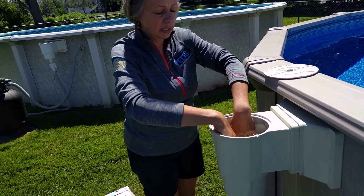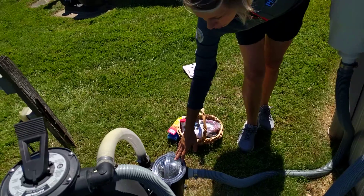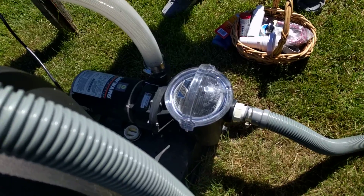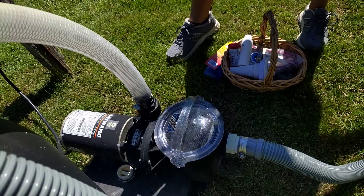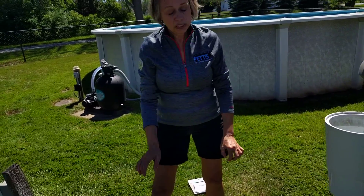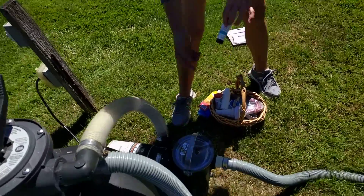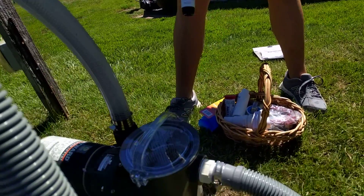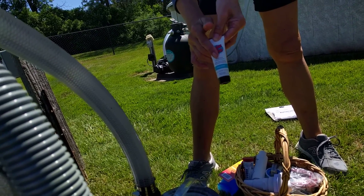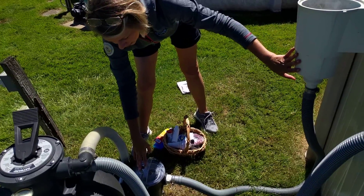So that's your first line of defense — clean out that skimmer basket. Water's going to travel from here, down your filter hose, down into your pump basket. It's got a few little things floating around in there — you certainly want to shut that off and then clean out that basket once a week if you can. It's really difficult to take off though — you've got to push down and give it a little twist. When you do, make sure underneath there is an O-ring. Every time you expose that O-ring, you want to lubricate that. If you're using chlorine especially, it can be a little drying, so make sure you keep that lubricated. First line of defense was the skimmer basket; second line of defense is your pump basket — keep that cleaned out.